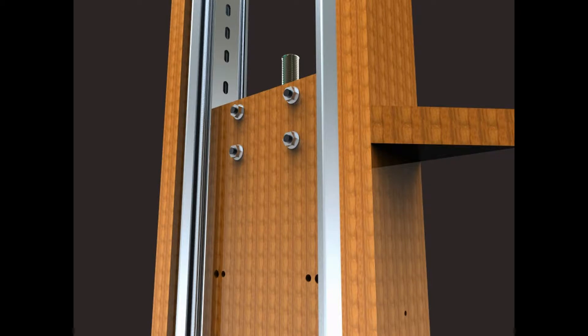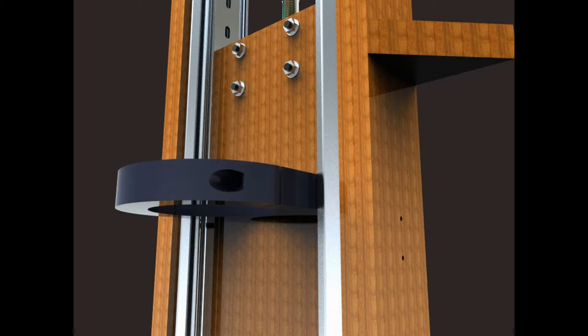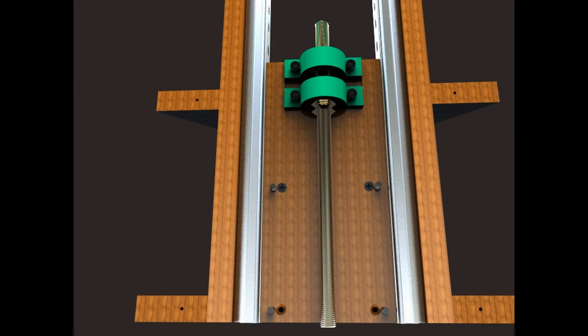In our next section, we're going to be inserting our screws that will hold the bottom half of our clamshell together. Remember, this is what is holding our router in place — this is our cut head — so this needs to be firmly in place. I've inserted screws in the back to hold the bottom plate in place in a specific area. Then we use our bolts to go through to secure the whole thing, so it's basically double secured. One is a point pulling and one is a point pushing, enabling it to adhere and connect more correctly. Here you can see where the bolts are inserted from the face side, with a cutaway showing how the bolts go through the entire part, with brackets on the top and bottom. All bolts are attached with nuts — the same type used to attach our anti-backlash device.